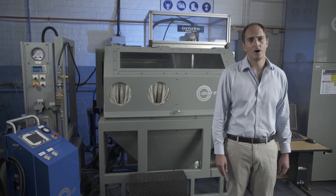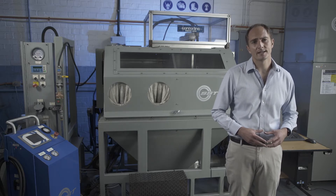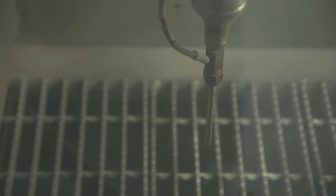There are two main types of cold spray machine: high pressure and low pressure cold spray. High pressure cold spray generally operates at around 50 bar, and this type of machine will be able to spray the majority of metals, including steel. One of the drawbacks with high pressure cold spray is that it has very large amounts of wear that happens to some of the components, so specifically the nozzles erode very quickly, and hence the process is expensive to run.